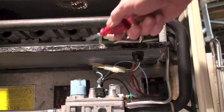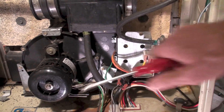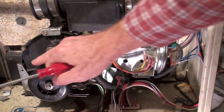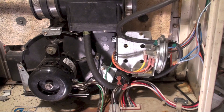There are your burners up here, here's your gas valve, these are more controls down here, this is your inducer assembly. This is a pressure switch — I want to look at this pressure switch and show you how this works. This type of pressure switch is not used any longer and it's a little tough to troubleshoot.